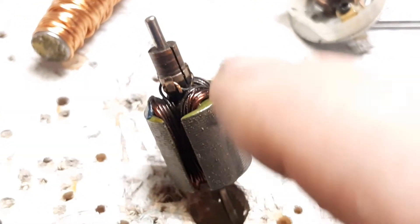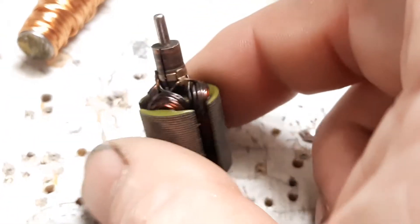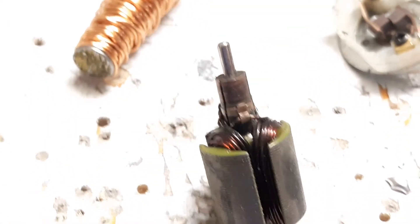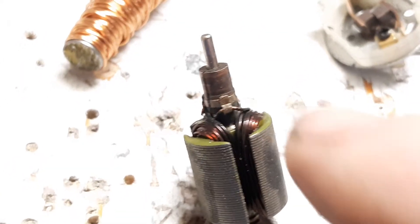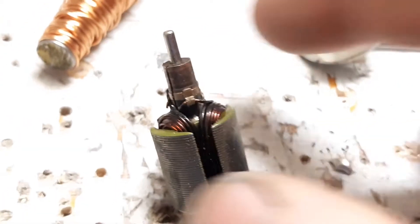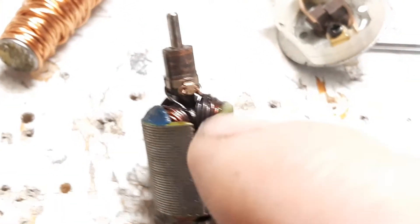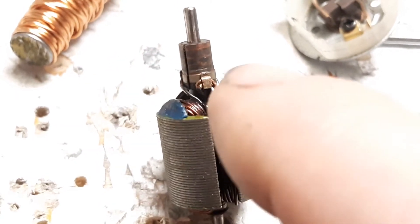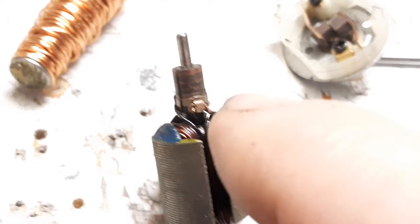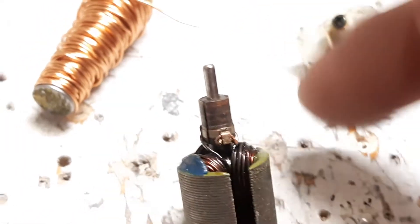In my case I'm going to do a 12 turn — so 1, 2, 3, etc., get to 12. Go around to the next one, scrape off the resin where the copper wire is going to meet that tab, scrape it around on all sides, put a little solder on there, heat it up and solder it, then 1, 2, 3 — 12 turns. Do it to the next one, then go back to your very last one after you're done doing all three. When you complete your last one it's going to go back to the very first one. Scrape the resin again, solder it in place, and then bend all your tabs back up.